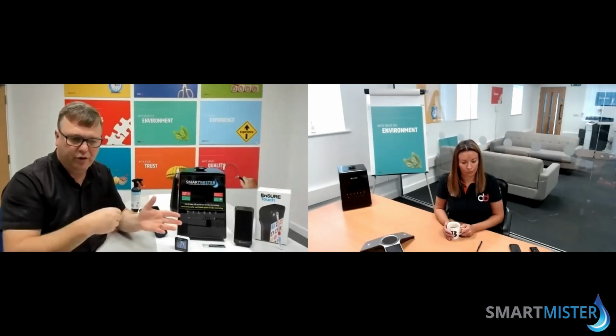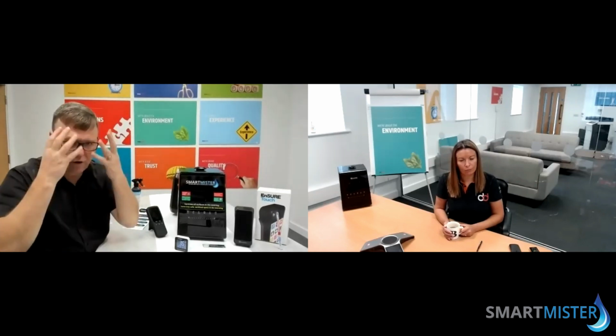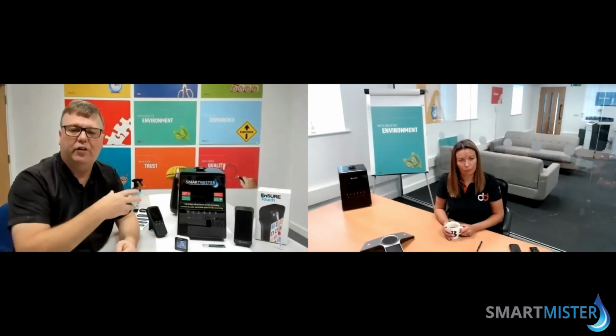So if you're leaving papers out on a desk, they would warp because it's a wet solution. You have to take all the books away. You have to take computers out of the room. It's a very invasive system. And then basically you spray a liquid as if you were spraying plants. Everything becomes dripping wet. So you spray it in one day, full hazmat, everything, and then go back next day and clean all that residue off and vacuum all the powder away and suck all the moisture, and then a day later open it up again.